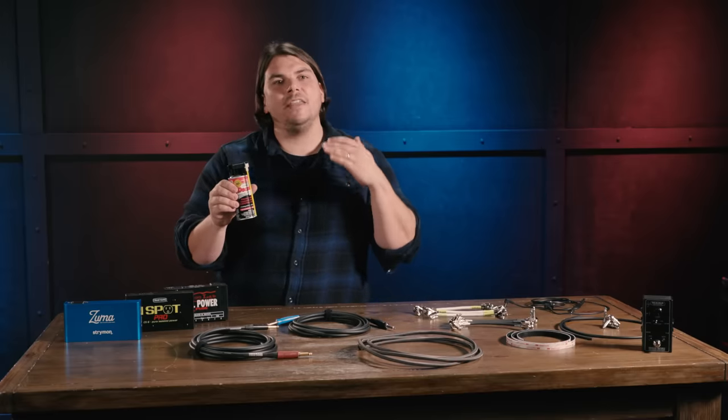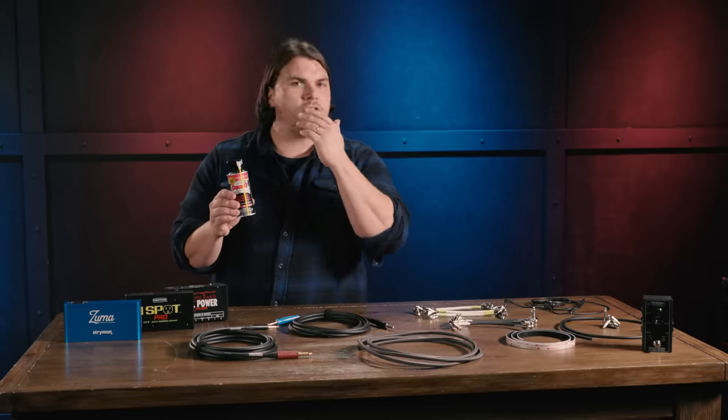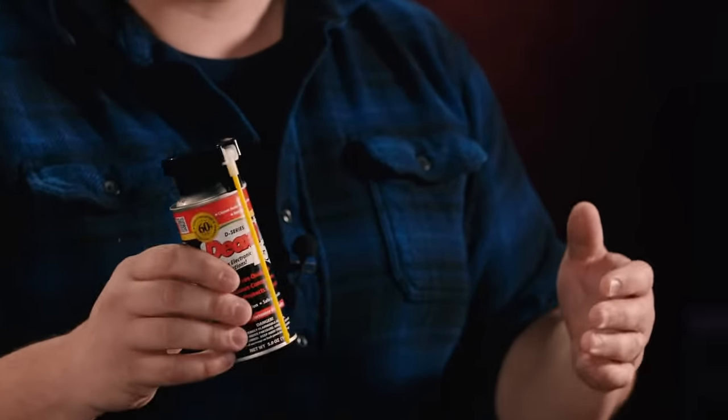Many times I have clients come to me thinking their pedals aren't working, but what's actually happening is their connections have corroded and oxidized and they just need an easy way of cleaning that out. Deoxit D5 is one of the cheapest, best insurance policies you can take out on your pedalboard. You spray this right in all of your electrical contacts — input, output, nine-volt DC — it's fine for all of that. You can even use it on your guitar and in potentiometers. It's literally a miracle for cleaning up scratchy pots and corroded jacks. Spray it in, work it through a few times, plug and unplug your jacks and DC connector, and it will clean up problems you didn't even think you had. It's a really great thing to have in your gig bag.